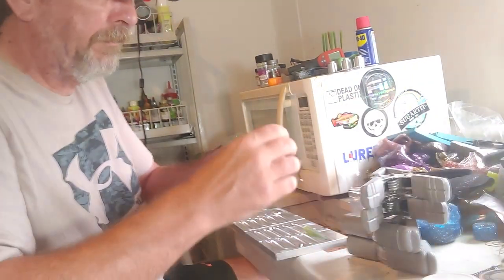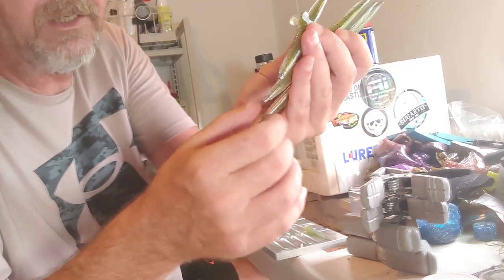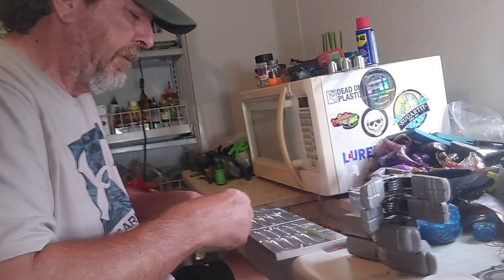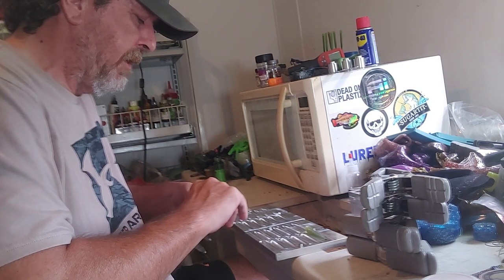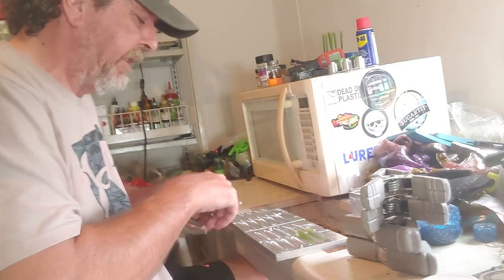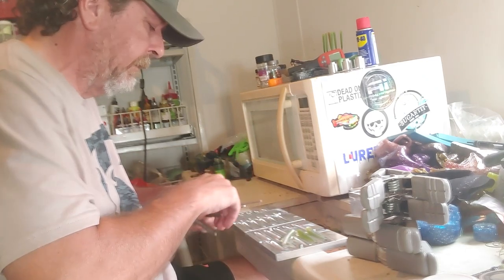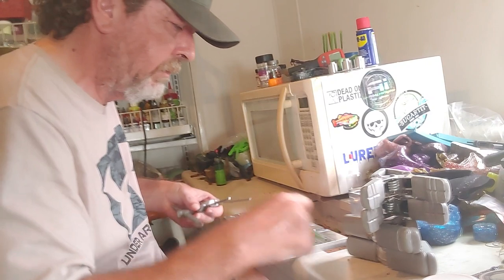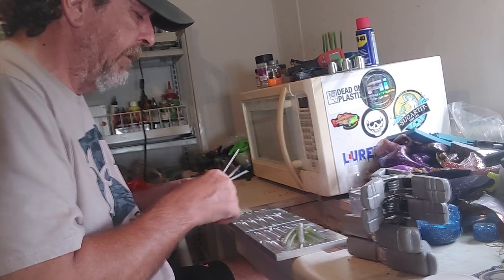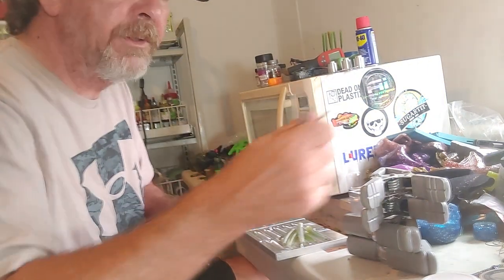Pulling the rods out. And again, I make sure I push the rods through to make sure the ends didn't get closed up around the rod. Because again, we want that middle core color to shoot right on through there. So you want to have your holes. Some people will cut these off. That's probably the best thing to do to make sure your hole on the sprue side is not covered up with anything. But knock on some wood, I don't have any problems with that. But again, other little tricks is to shoot that core color hotter so it flows better.